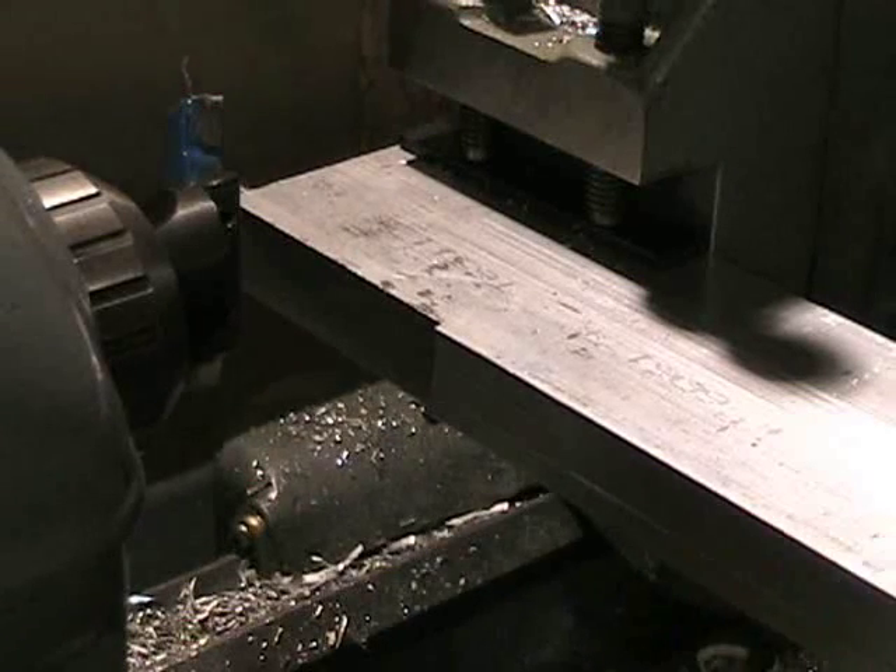I'm going to be cutting an inside curved radius gouged out of the bar so that it fits the radius of the telescope. To do that I have a tool holder mounted in the four-jaw chuck that I'm going to use essentially as a fly cutter to gouge out the bar. This worked quite well — we've cut out a nice curve and it only took a few passes, the last one being really slow to get a nice smooth finish. To get the leading edge I had to get the whole apparatus in pretty close to the milling attachment.